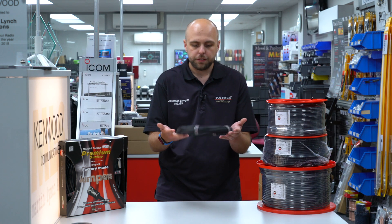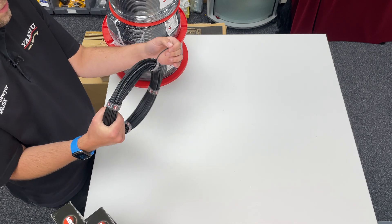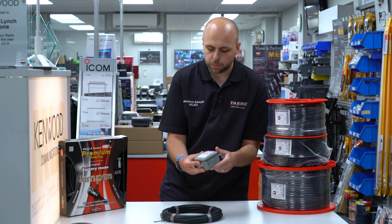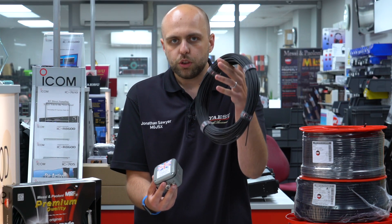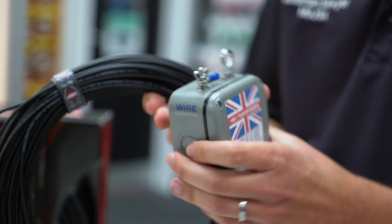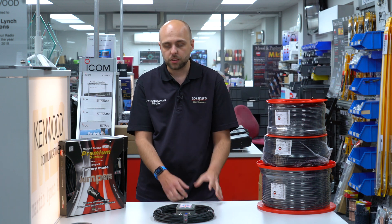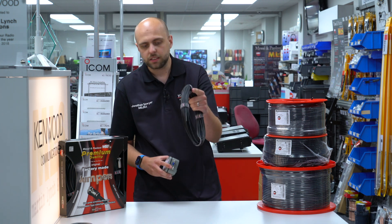Also available, we have a 50 metre length of Dipoflex. This is a really lovely wire if you're going to be making wire antennas. We've specifically catered for 50 metres on a drum to go along with our 49 to 1 transformer. What you can do is take 10 metres off that and use the remaining wire to tune with a 49 to 1, and that'll get you working on pretty much every HF band from 80 metres upwards. The guide length is 38.9 metres, so cut about 10 metres off and you'll easily be on the air on 80, 40, 20, 15, and 10 metres. With the aid of a tuner, you'll also get on 17 and 12 metres too, and possibly even 60 metres.